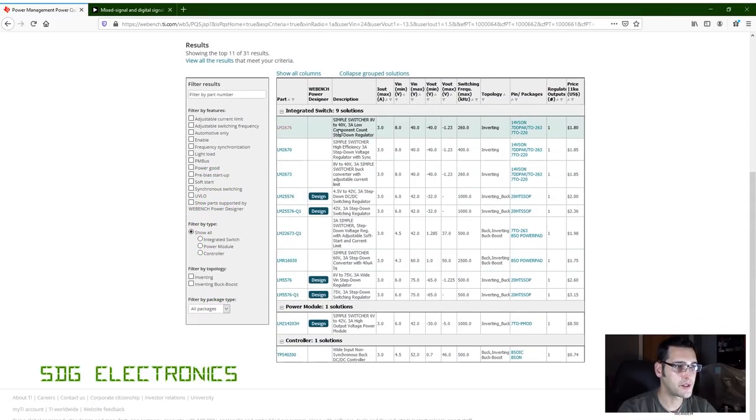We've got quite a few chips here. The LM2676 is highlighted because I've recently used it on another design — it's a really simple DC-to-DC converter and relatively cheap in volume at $1.80. Unfortunately you can't design with this part in Webbench Designer so we won't be able to do simulations, but it's such a simple part it's very tempting to use straight off — you really only need an inductor, a few resistors, and some capacitors. The Simple Switcher range is really good, especially for beginners.